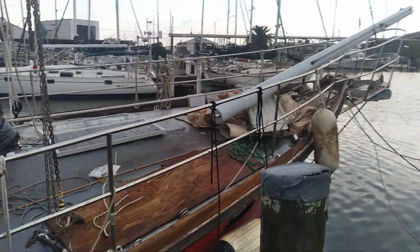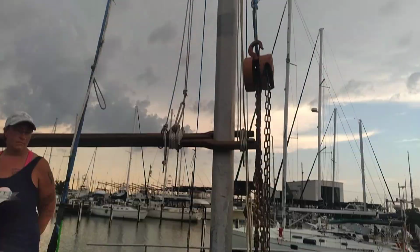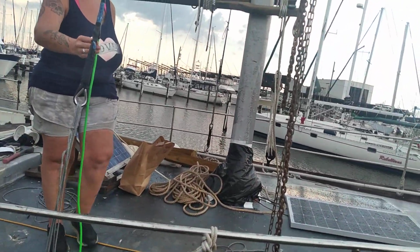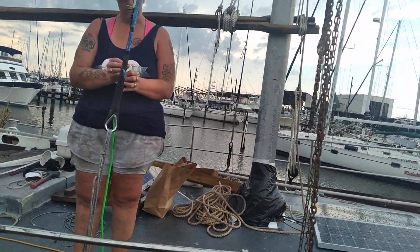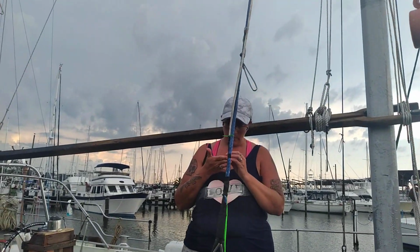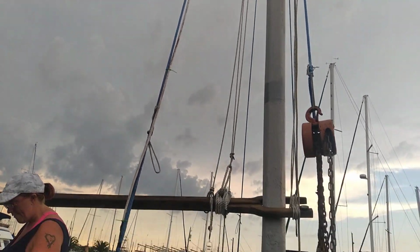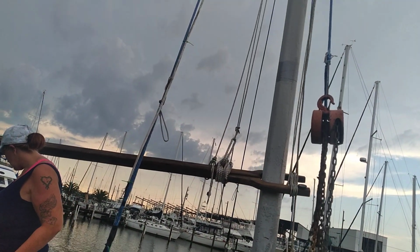We right now, as you can see, are working on the rigging, the Dyneema, and yes, that is a chain fall. That chain fall is up to 2 tons, and my rigging holds 38,000 pounds, and that mast with strength tests has quite a lot of bending force to it and quite a lot of strength. I have to be careful so that I don't explode it, but it is also encased in fiberglass.